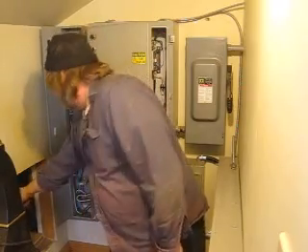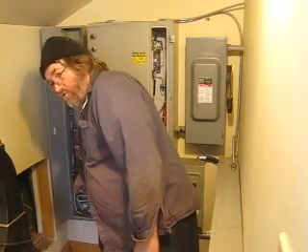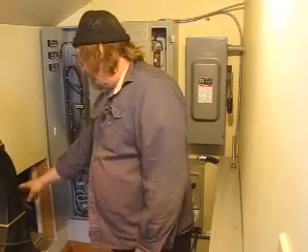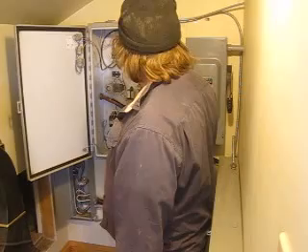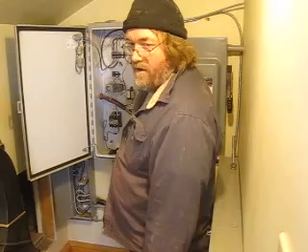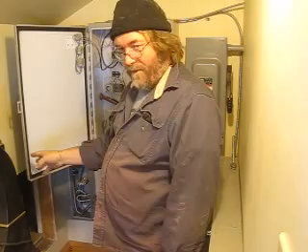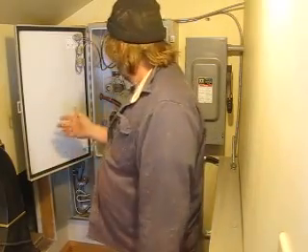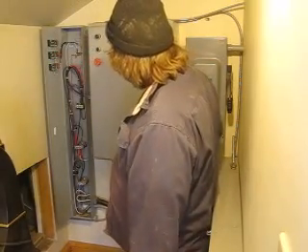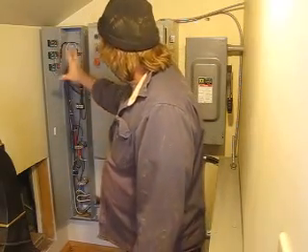Those are my main generated lines. The idler motor hooks on to the red and the black, and from there comes out the blue — which I'm calling the generated leg from the idler. I've fed that generated leg all the way back through a contact block, so when that contact block closes, no power from the idling-down phase can come back into the system. From there you can just add plugs for your 240V outlets.